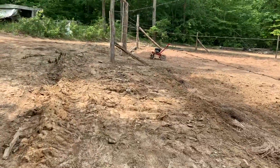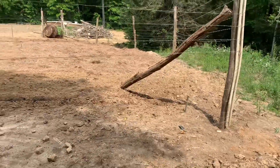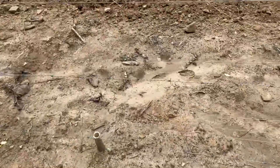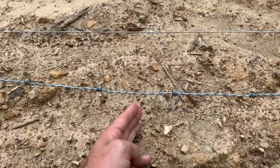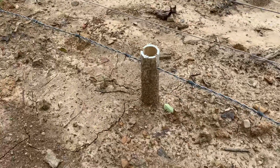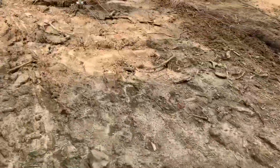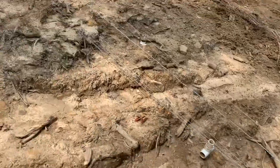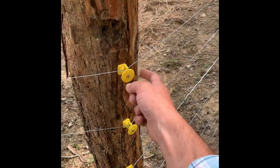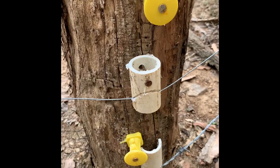In my case I've gone quite a distance between the posts — probably a good 50 feet — and in order to keep rabbits out I wanted the wire to be really close to the ground. I'm not sticking my finger down there because it is on, but it's about three fingers' width from the ground. I use a small PVC pipe with a notch in the top every so often just to keep the wire from sagging and actually touching the ground. I did purchase some commercially manufactured insulators but this works just as well.